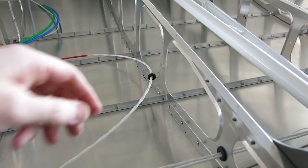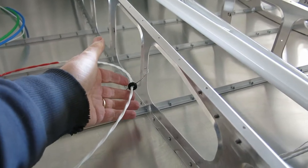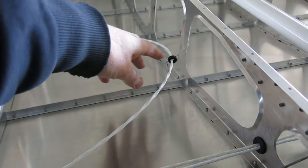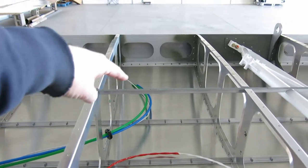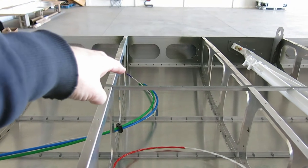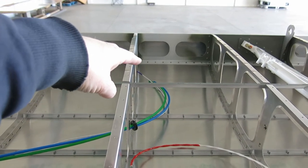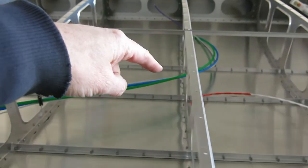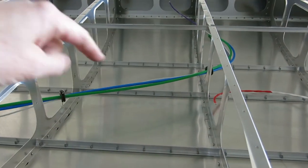And we installed, I did a grommet here for the wiring for the pitot heat. So it comes out here, we get a little strain relief here, and then that will wire into where the pitot is installed right here. The other wire with the purple on it is the outside air temperature gauge wire, and I'm just running that along with the tubing for the pitot and the AOA